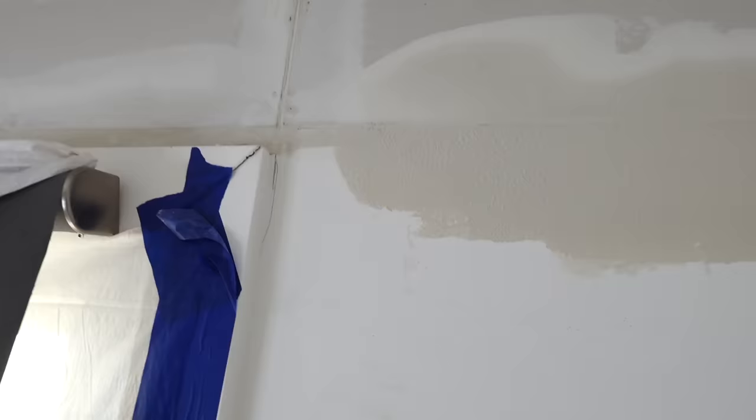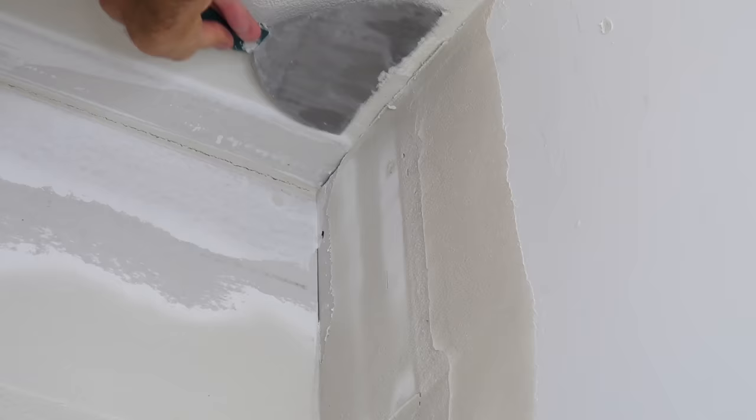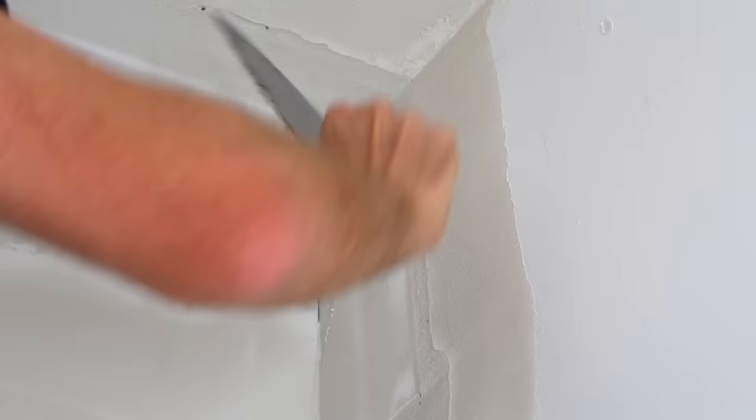Let's take a quick look so you can see what it should look like. Because it's not guaranteed to be level or even everywhere, there ends up being quite a wide pre-fill just to make sure you can get it flat enough for tape and minimize how much mud you have to put on after, especially on the ceiling. This drywall on the ceiling was just a little bit proud almost everywhere, so it's feathered out pretty wide so that when I put the tape on, I don't have a giant hump to feather out — it's more just a long flat thing. My pre-fill is pretty flat, but I often have a little bit in the corners. The less lumps you leave under the tape, the flatter your work's going to be.